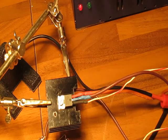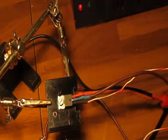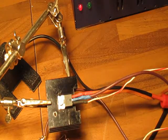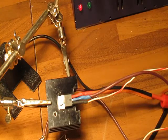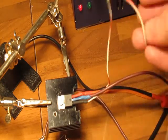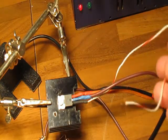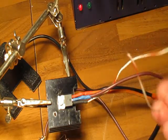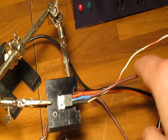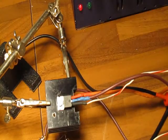I hooked up one of those devices with some cable so it's easier to handle, and I also added a heatsink. It's not really needed for this experiment, but it was easier to handle than the device itself. The little white and red wire is the gate — the one that controls the flow of current. The brown one is the drain and the orange one is the source.